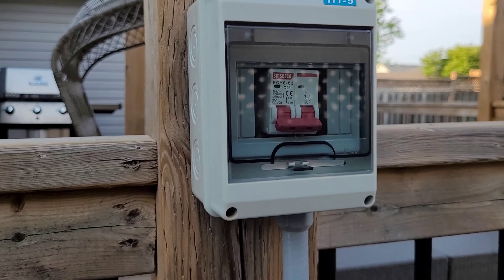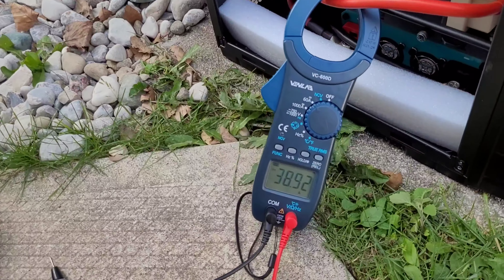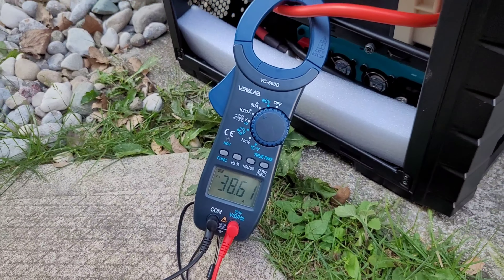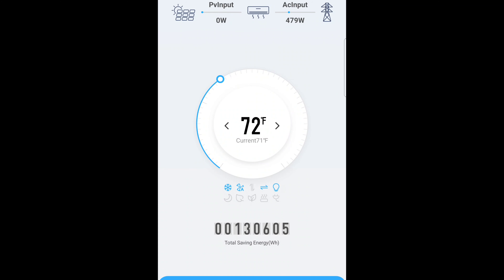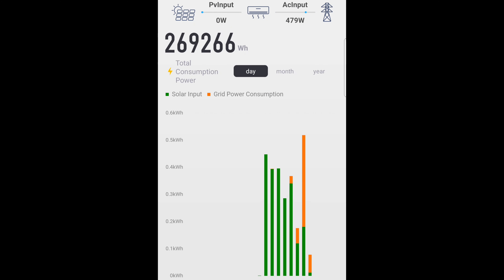Here's the solar breaker — you can see I do still have it off. We're holding right around 39 amps, which is about 500 watts. Just short of 500 watts — running at about 480. I'll open the power consumption for the day so I can show you how many kilowatt-hours we use. This will record how many kilowatts between 7 and 8 PM. We've used 0.069 kilowatt hours so far, which is about 69 watt-hours — we'll check back in with that after.